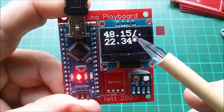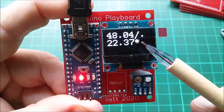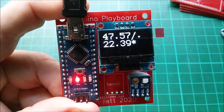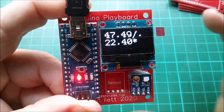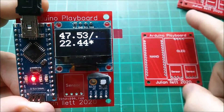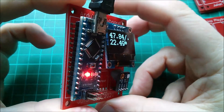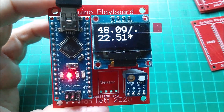I've used characters from the numeric fonts to fashion a very crude percent sign — just a slash and dot — and a very crude degrees sign. The numeric font only has about eight other characters so they're rather crude symbols, and I can't have a 'C' there, so you just have to take my word that it's 22 degrees Celsius. That's my Arduino play board: a PCB designed not to take any components but instead to take these pre-made modules you can buy cheaply on eBay. This is really hurting my fingers holding that Nano at that precarious angle — but it just seems to be staying there. The concept works!